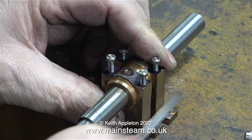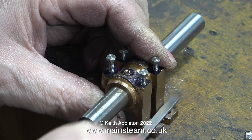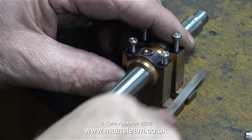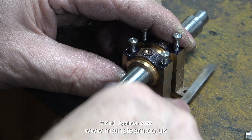As with the pedestal, I drilled the holes smaller to start with. If the holes are drilled slightly off, you can use a round needle file to correct them, and then re-drill them to the proper size. Here I'm also using a flat needle file just to flatten off the mountings.